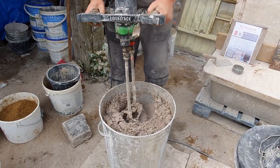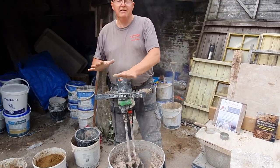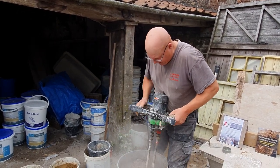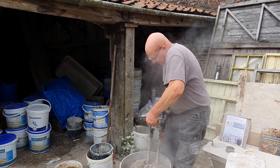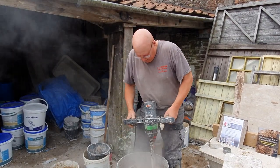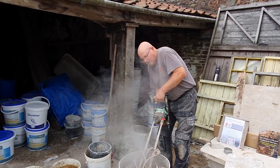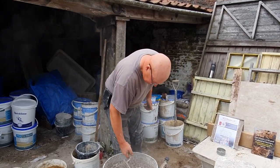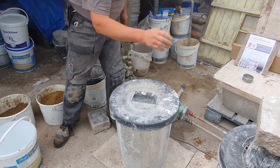A little bit dry, but we will leave it steaming because it'll finish slaking off then at high temperature before we add any more water, because if we add it now it'll chill it and it'll go too cold to finish slaking. So we'll put the lid back on that and we'll have a look at the other one.